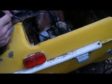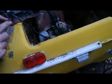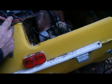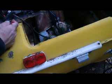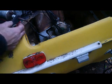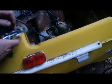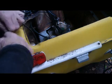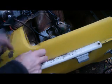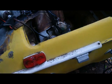I want a little more length here so I can put the heat shrink on. If you put the heat shrink on too close to the joint you're soldering, you'll shrink it during soldering and won't be able to move it. I'll undo the other end of this wire so I can pull it out and strip it — there it is stripped with strands twisted. I'll put the heat shrink on first, then solder.